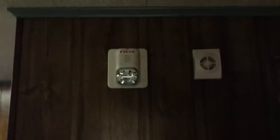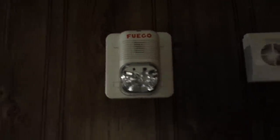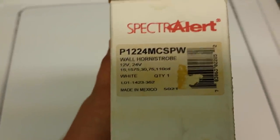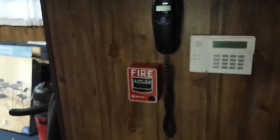And up here we have a very rare alarm. This is a System Sensor P1224 MCSPW — yeah, that's a heck of a model number. This is a multi-candela horn strobe with Spanish lettering, and it's also white in color, which — white Spectral Alerts weren't quite as common. I wouldn't say they're rare, but they're certainly harder to get than the red ones. Both the Spectral Alerts have been pretty much staying in sync when I've been testing them. The system is coding them to code 3. Let's go ahead and pull it.